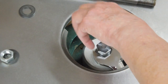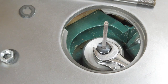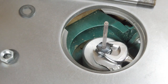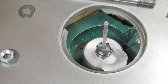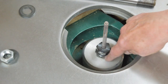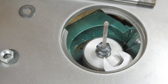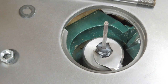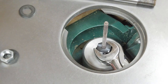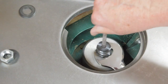If I take one of these small spindles that's down in there, I can reach in with the 29mm wrench and very gently snug that up. I want to be careful when I do that because if I get carried away, I'll end up loosening this nut. You don't want this to get loose. If these two nuts work loose, that center shaft will drop down inside the gearbox — then you'll have another problem. Don't ask me how I know that. When these get on there tight, I can reach in here, just loosen that nut and take the spindle out.